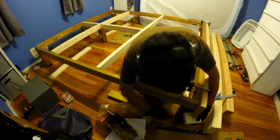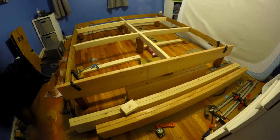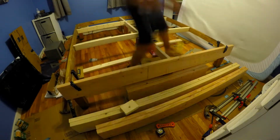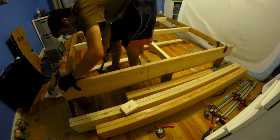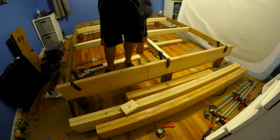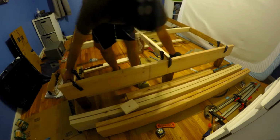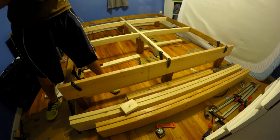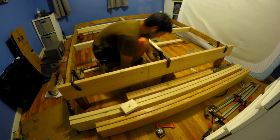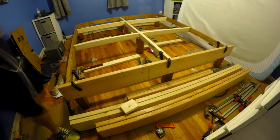But getting off of my motivational speaker soapbox for a minute, how do you actually install these? Well, I have marked down in the description which ones go where on the bed. This is the same thing from the first episode description when we were cutting everything. Then I am loosely fastening a clamp at the two far sides of the bed so that those become the pivot points for the board when I make adjustments to the height. I am setting this board so that the top of it sits 2 inches above the 2x4 on the frame that it is next to.